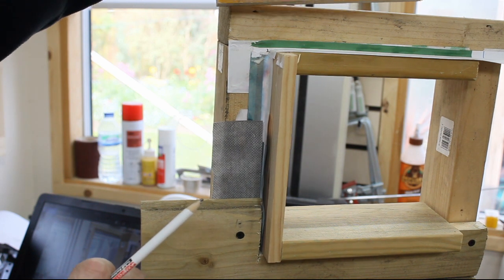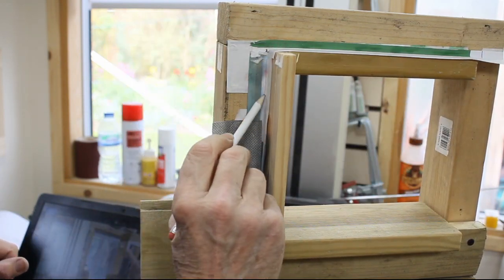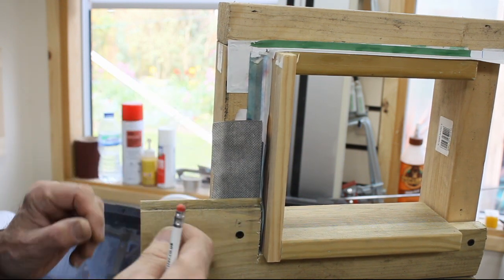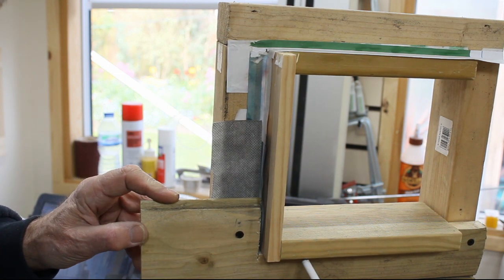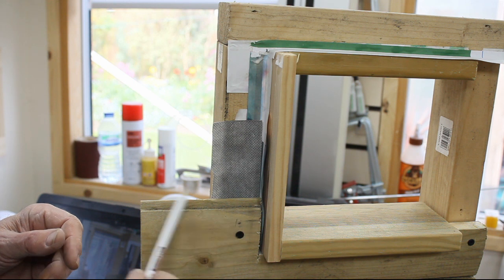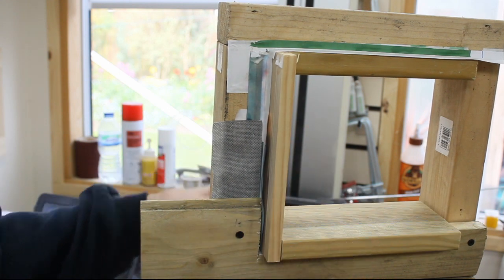On the top, where it's exposed, because the cladding doesn't cover the whole of that stick out bit, I put the flash band right the way across, wrapped it over the top, and again sealed all the joints round. Once that was done, the cladding was all bedded in mastic around it as well, and the cladding was then sealed on the outside with mastic. So I don't think there's any chance of water getting in at all through that now.